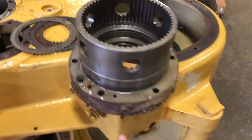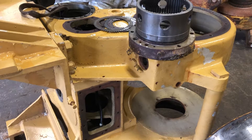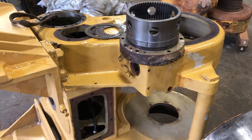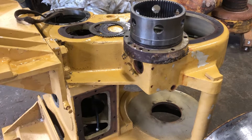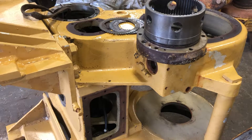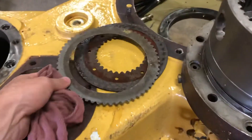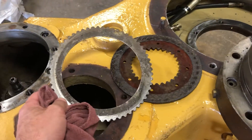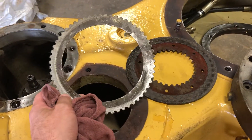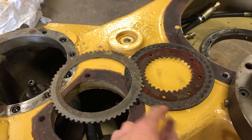See, there's the inside of it. This is the older design. Give us a call and I'll tell you the serial number break, but if you look in your parts manuals, you'll note that there's a slotted and a splined clutch and brake assemblies. These are what's coming out of the clutch and brake for the splined. This is the separator plate, which you can see has the teeth on the outside and the friction teeth on the inside.